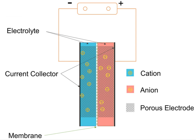The short distance is accompanied by low electrical resistance. The greater the distance the ions have to cover, the higher the resistance. This phenomenon can be described with a series circuit of cascaded RC (resistor, capacitor) elements with serial RC time constants. These result in delayed current flow, reducing the total electrode surface area that can be covered with ions if polarity changes. Capacitance decreases with increasing AC frequency. Thus, the total capacitance is only achieved after longer measuring times.